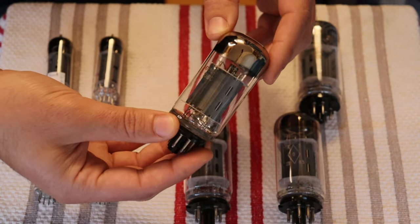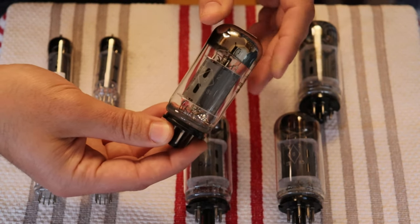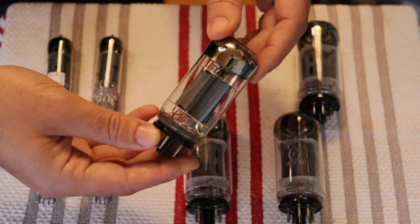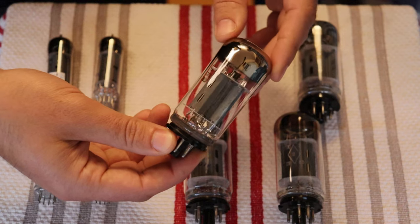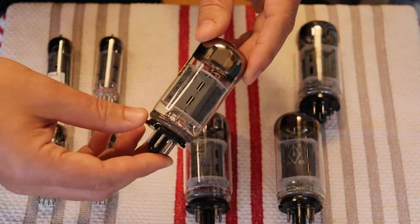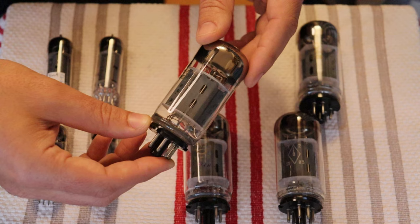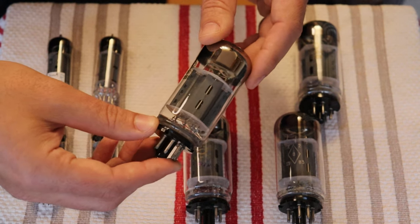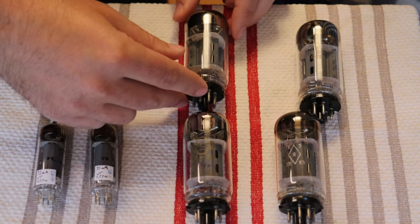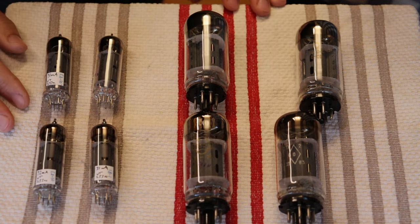Yeah, and when I designed my first monoblock for our own home system years ago, this is actually the tube I based it on, and they are great sounding tubes. Just a very clean, fast sound. Fairly neutral, and rock solid. I never actually burnt one out. Yep. And we've got some beautiful tight matched quads of these in there as well. So they're ready to go, and they should drop into just about any 6L6 slot that's out there.